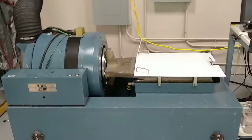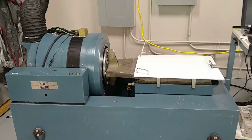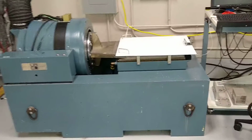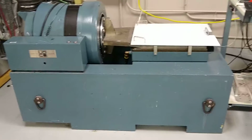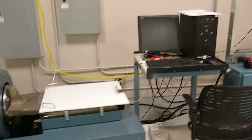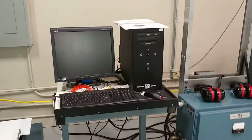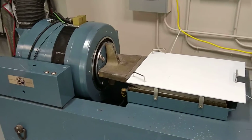In particular, you will loosen screws. And these screws can be very, very dangerous because they will shred your satellite pretty much apart. Now, when we talk about these vibrations, these are basically like ultrasound vibrations. And every rocket has its own pattern. And we have the pattern of these rockets in our computer here. And our computer controls this vibration table.